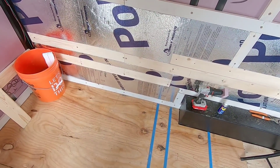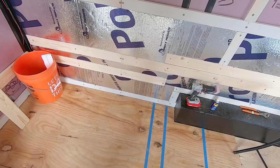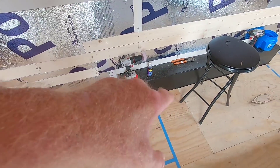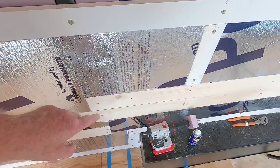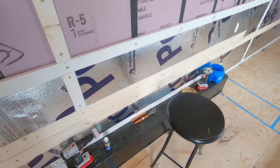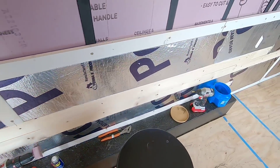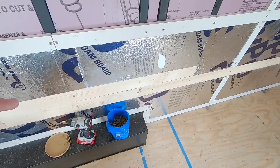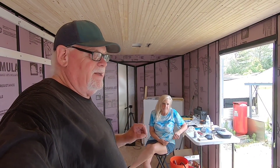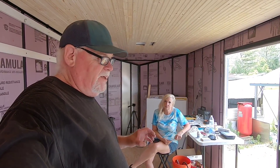We're raising the floor six inches for another reason, which has to do with a sump pump we're going to use to pump the gray water from the shower and bathroom sink up into the gray water tank over in this area. The extra furring strip we put right here is close to where the top of the bed frame is going to land. Keep in mind, folks, these things are rolling earthquakes when they're going down the road, so we need good meat there to attach the bed frame securely.